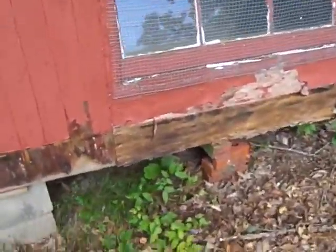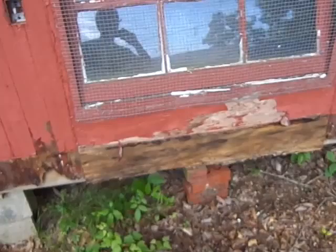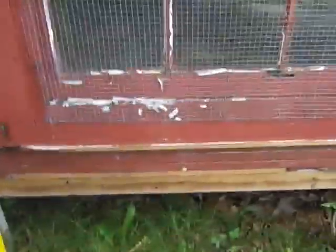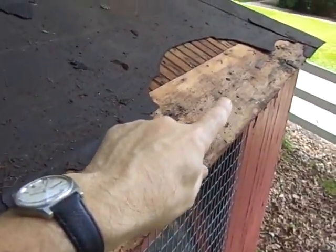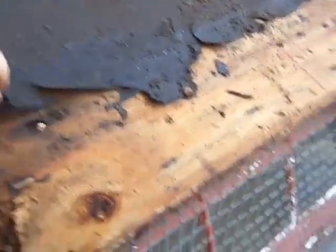Here's another side with the windows, and you can see how this plywood piece that was spliced in years ago has kind of suffered as well. Now I'll climb up on the roof — or at least get on the ladder. You can see this details how it was fixed previously, probably in '93 when the building was moved. It looks to me like it's all limited to this piece here, so the fix would be to get them off, strip off the tar paper, take this off, and then piece in a new rim on the roof panels that need it.